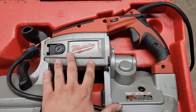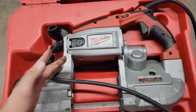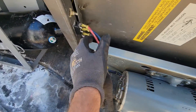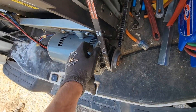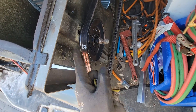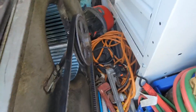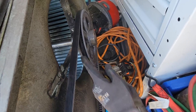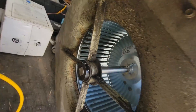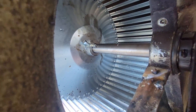This bandsaw comes in handy for cutting unistrut, for cutting keystock, for cutting shafts. Ready to install this blower housing inside of this commercial package unit. This is where the wiring will plug up to our three-phase motor. We got the adjustable sheave here. We got the idler pulley or tensioner pulley installed. We got good tension — our fan belt is not too tight, not too loose. We got the non-adjustable pulley on the shaft. Wheel is lined up. Bearings are tight. Installed the keyway using the keystock.